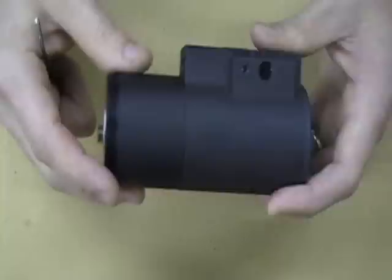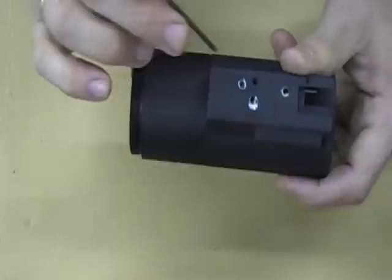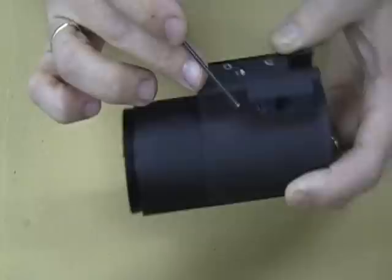This is how the unit looks once it's stripped down from the barrel and the fitting. There are three screws that are not something you should touch — they're not for maintenance. This is one of them, and here are the other two. They're all the same screw: a 10-32 set screw that is wrapped in Teflon.